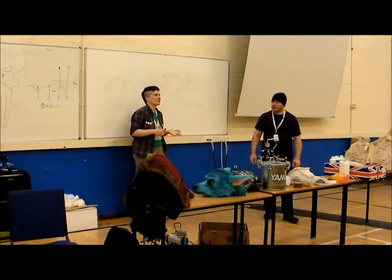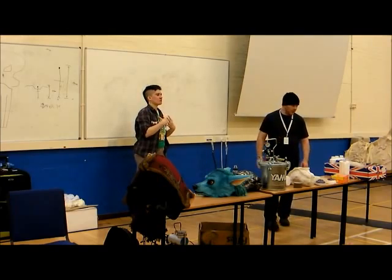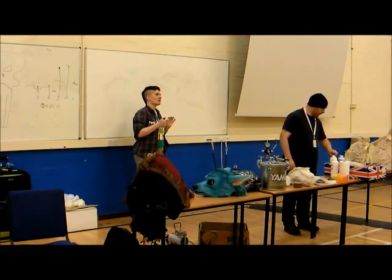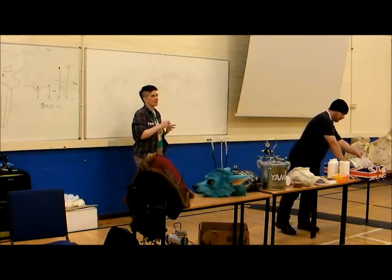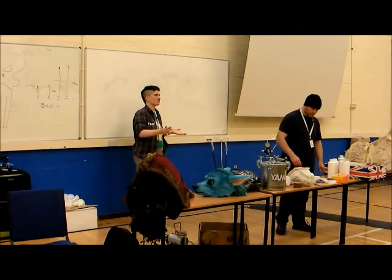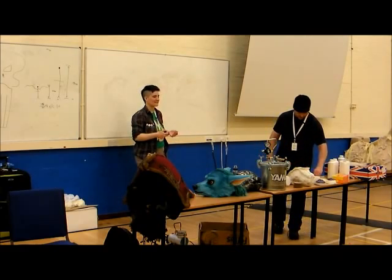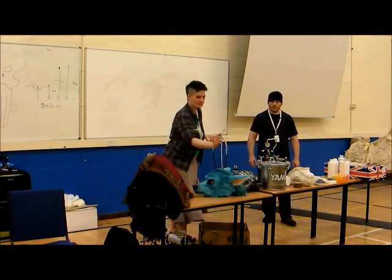So you decide what you want to do. If you're just starting out casting, things like jewellery objects are good, especially if you're going to have multiple ones, because if you only have one, it's often worth just making it out of Milliput or whatever. If you need 20 of them, all identical, hanging on a big necklace, it can be worth having a mould and just making casts in resin. The other nice thing with resin is if you lose or break it, you can just make a new one quite easily.